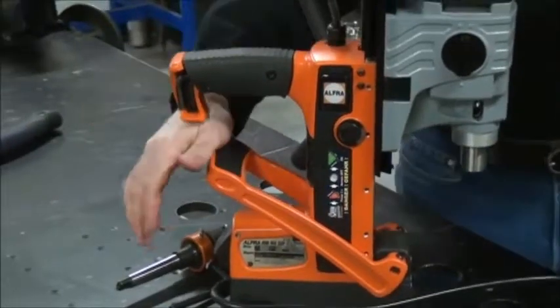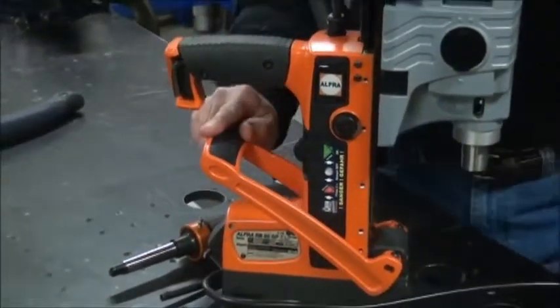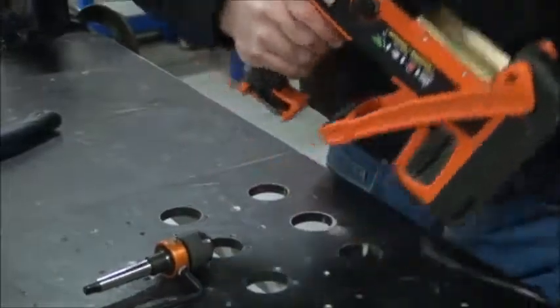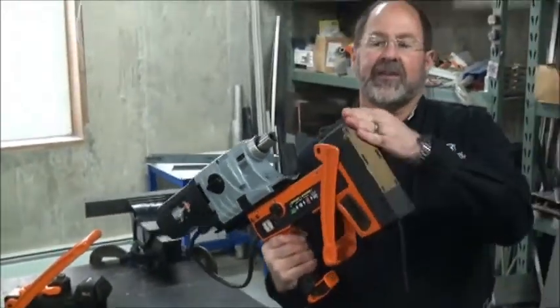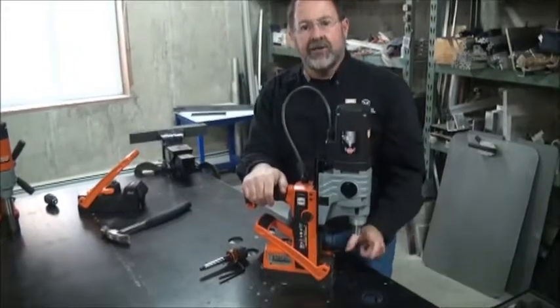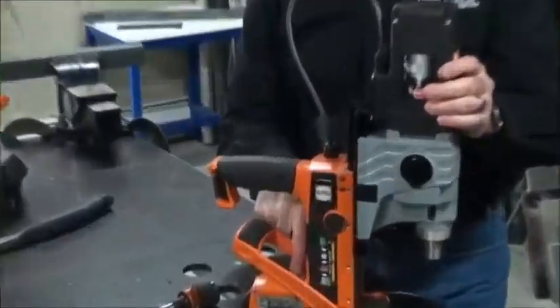Some of the neatest things about this unit: the switchable permanent magnet is of course one of the huge ones — the fact that by switching to this magnet we're able to make it a far better, far more effective unit is awesome. But the fact that we're able to take about eight pounds out of the unit may be my favorite. If you've ever had to use one of these vertically or upside down, you'll really appreciate only twenty-two and a half pounds on a top-of-the-line, industry-leading two-inch drill.